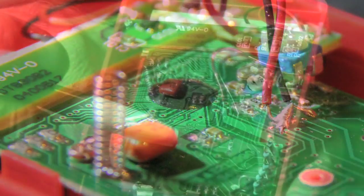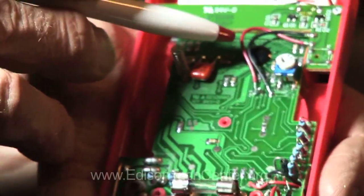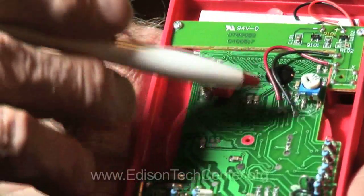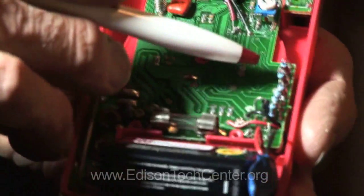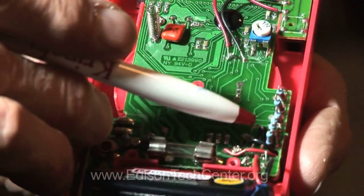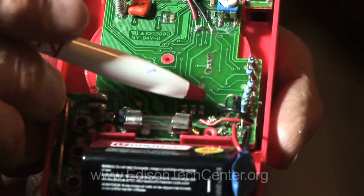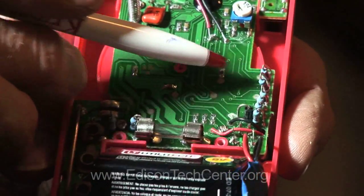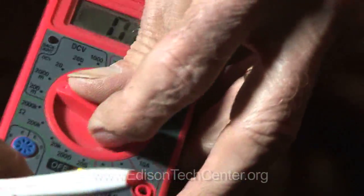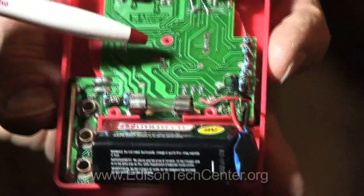The different voltages are read the same way the vacuum tube one is, except in this case we can use much smaller resistors because the impedances are so much higher and the currents are much lower. Over here are the series of resistors that switch the voltage and current readings, selected from the switch on the front. As we turn this switch, it switches in different resistors along here.